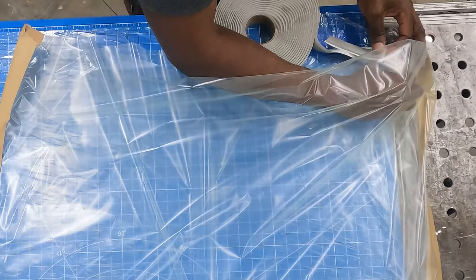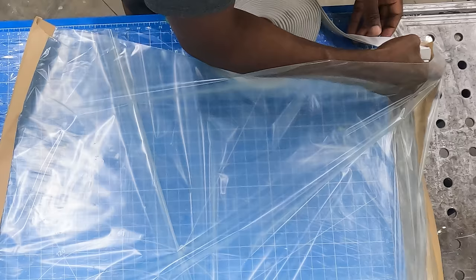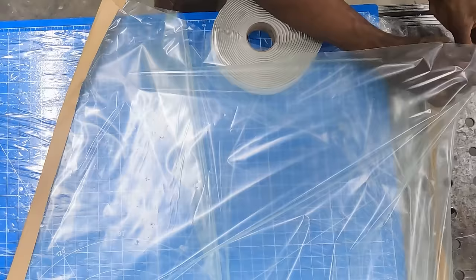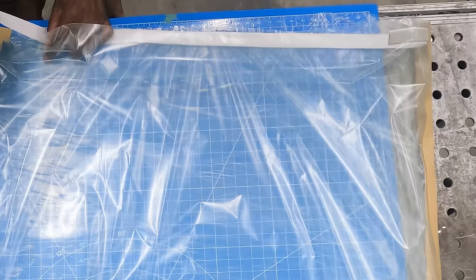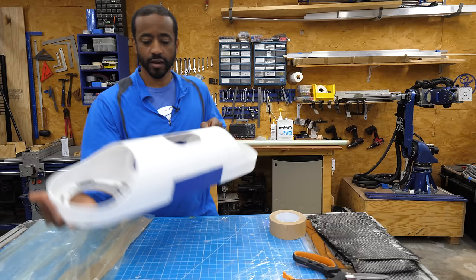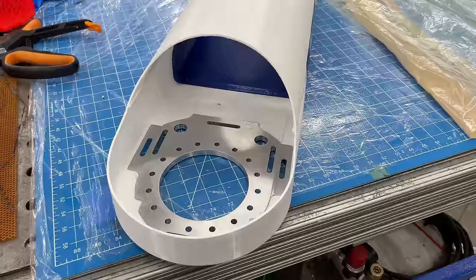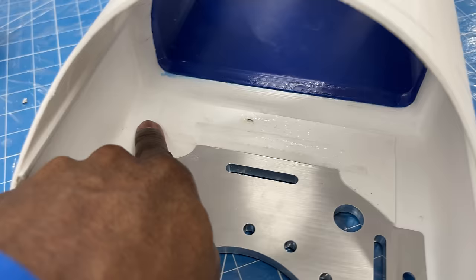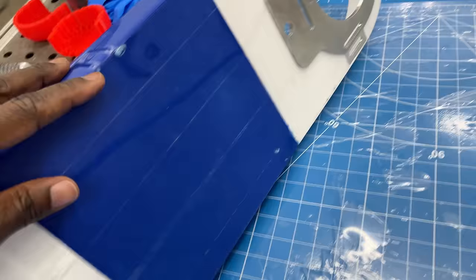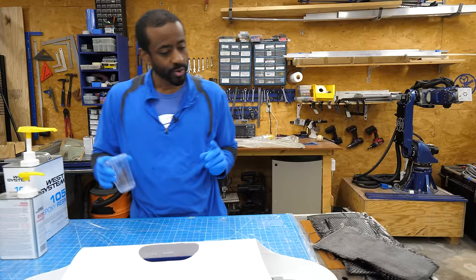Then we should be ready to go. I've made some improvements to the internal structure by adding 3D printed pieces to better sandwich the metal part with the plastic part. I've chemically welded the plastic together so it should hold long enough to get the carbon fiber on — the carbon fiber is where all the strength is really going to come from. The slots I have everywhere are anchor points where I'm going to push the carbon fiber through so it has a little bit more material to hold on to.